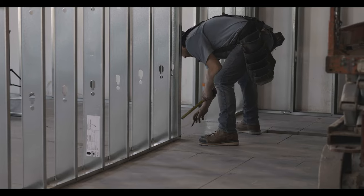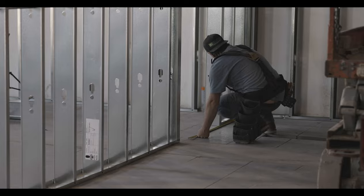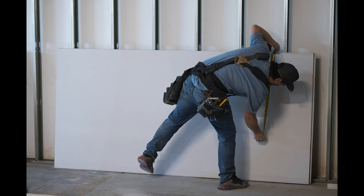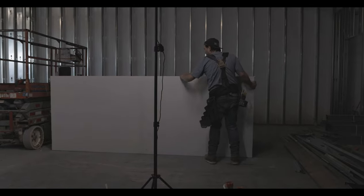Right now what I'm doing is checking my layout to make sure the sheets will hook the door properly. I'm checking both ways and finding the best layout. You always do that on your sheet. Here I'm drawing centers — I'm drawing 16 and 32 on my sheets — that way I can set my studs at the top in the field. This is me using a knife, basically the same technique: cutting and drawing.